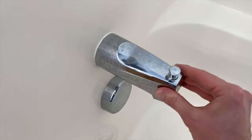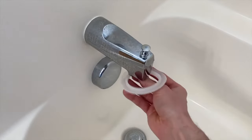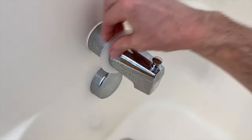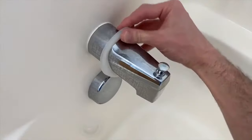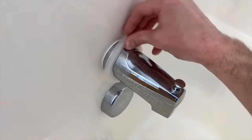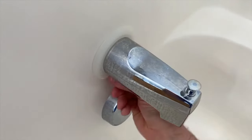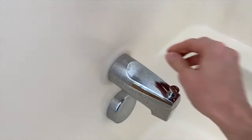Make sure it's straight. Making progress — the lower screw is secured. Now we have this rubber seal and we are going to carefully reinstall it. All this does is eliminate the need to run a caulk or silicone bead around your spout at the surface where it meets the shower wall — this is a cool little gasket to have. Push it all the way flush with the shower wall, as shown here.